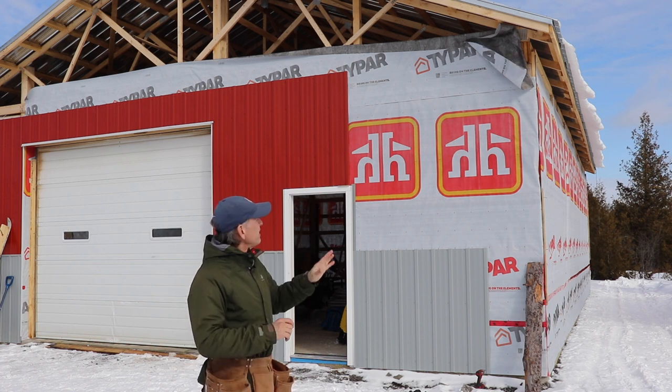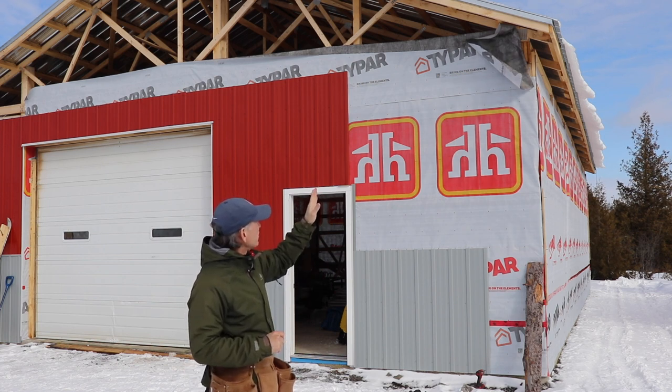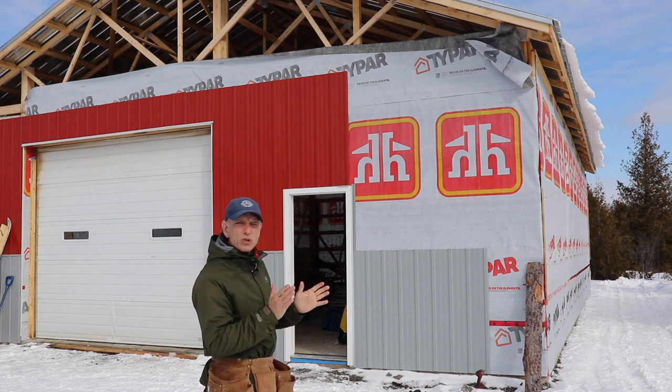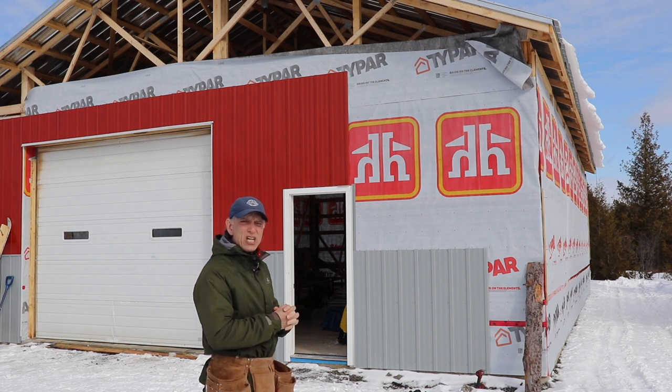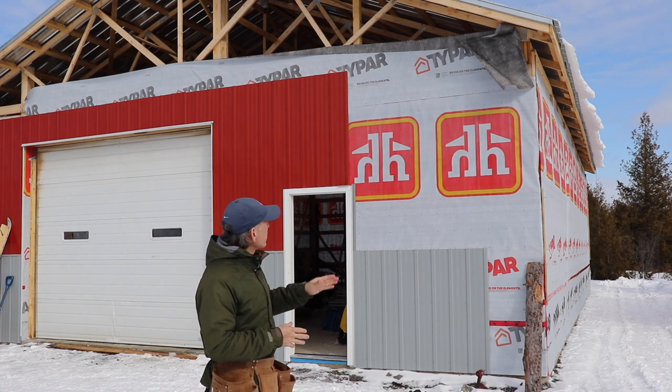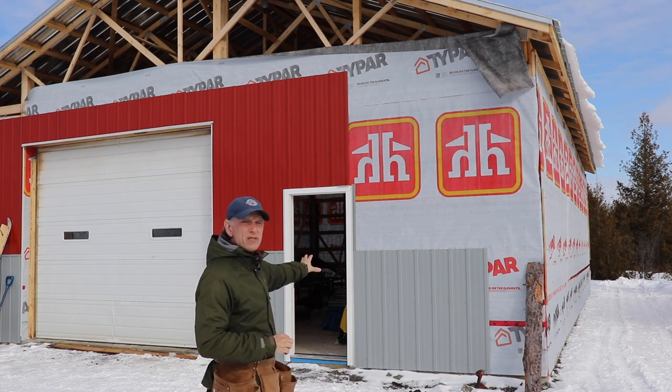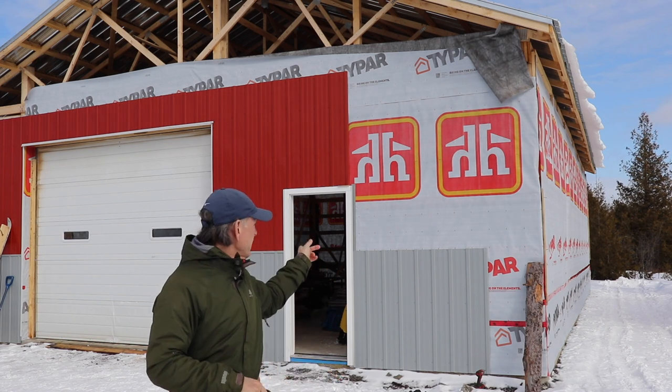It's got the beam where the trusses meet, and one of the 2x10s up there doesn't quite come to the corner, and one actually protrudes too far. So I got to get up there with my chainsaw, trim one out, but then also build up part of the corner as well. I had some terrible audio with this clip, so I've had to kill it and do a voiceover here.